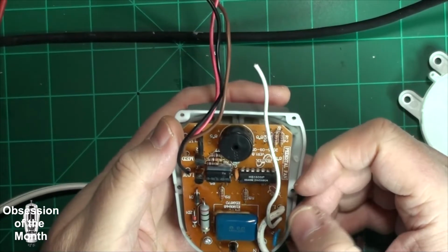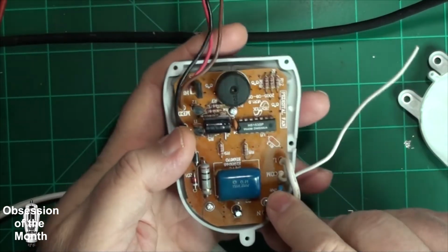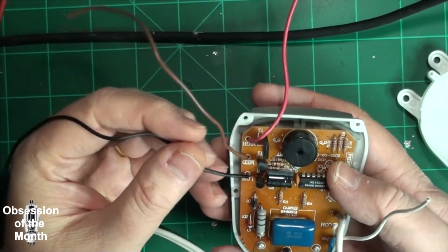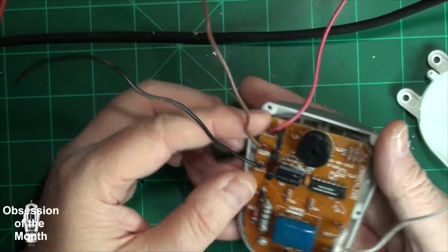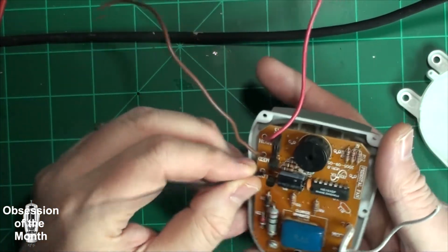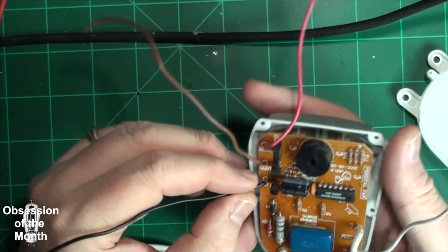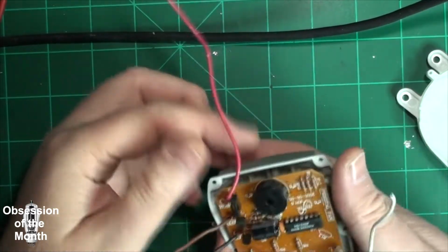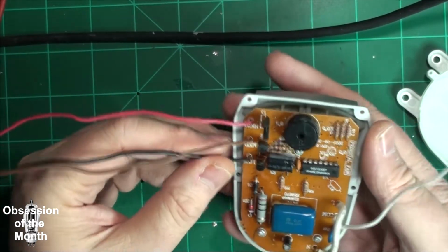and they all work on the same basic principle. You have a common wire. You see it's marked COM there, and then you have 3 wires that are usually labeled, they may not always be labeled, low, medium, and high. The way this works is that your fan has 3 different windings in it. I'd always wondered how they control the speed of the fan, and the way they do it is there's 3 separate windings. They just put out 115 volts directly into the fan, and it goes across the particular winding, and depending on how they've wound it, you get low speed, medium speed, or high speed.